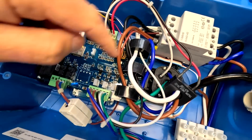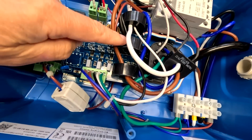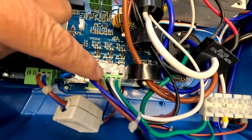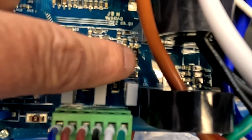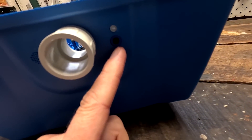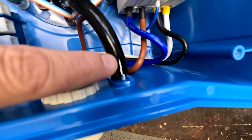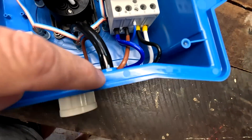There are smaller relays on the board — one of them switches the large contactor. There's also a connector for measuring voltage while the current transformers measure current. You can clearly see the isolation on the PCB between the high-voltage 230V side and the low-voltage controller side — only certain components bridge across that boundary. I also noticed what looked like a 3.5mm jack at the bottom, but it's actually just a hose: if any water collects in the Type 2 connector from outside, it drains down this hose and out at the bottom of the case.